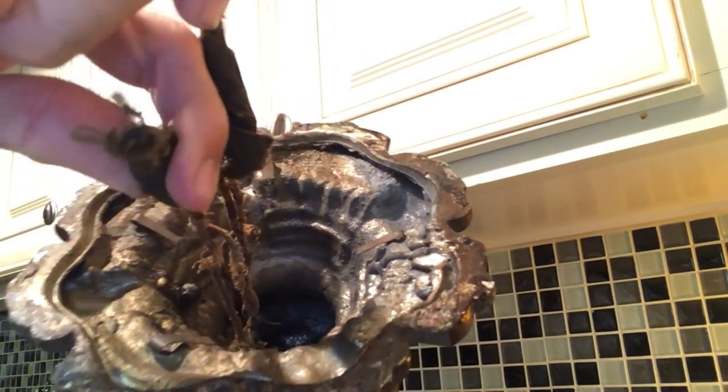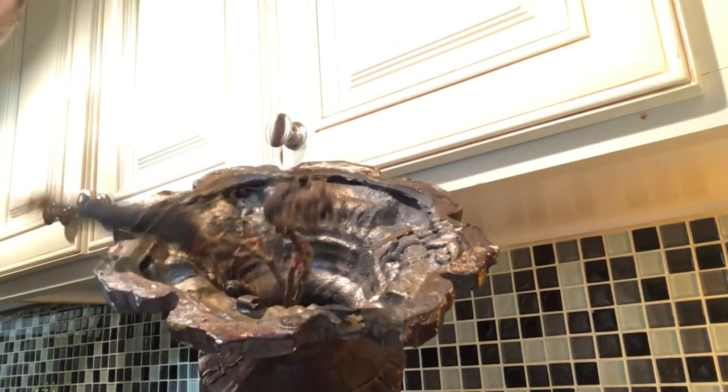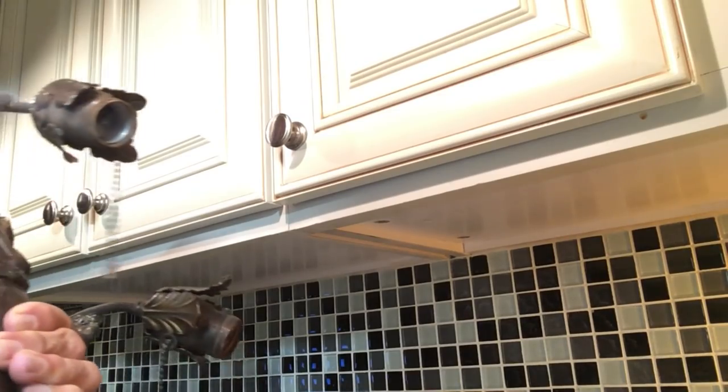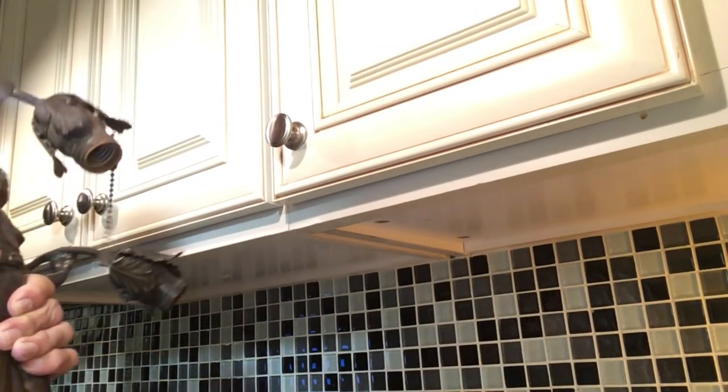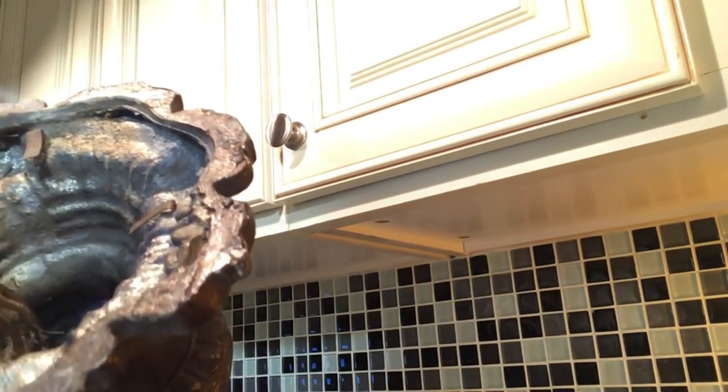Oh yes. So this is what's holding us up, is all of this. Now that is some original turn of the 19th century wiring in there. Okay, you'd be a fool to plug that in. By the way, I forgot to tell you, how can we tell if this is bronze or spelter? Bronze is going to have a yellowish color if you scratch it. Spelter is going to look silver. And because we can turn this upside down and look, you can see the silver color of this spelter underneath,